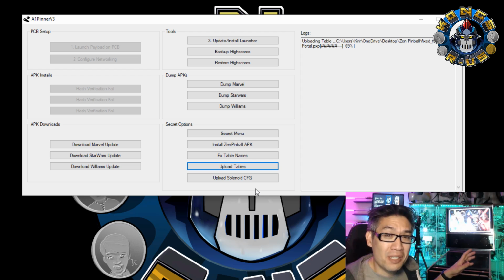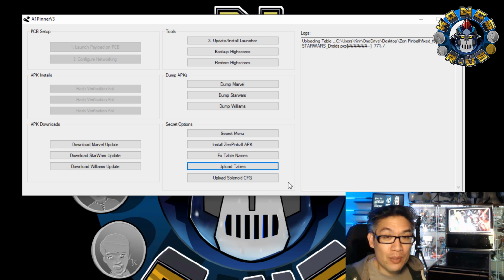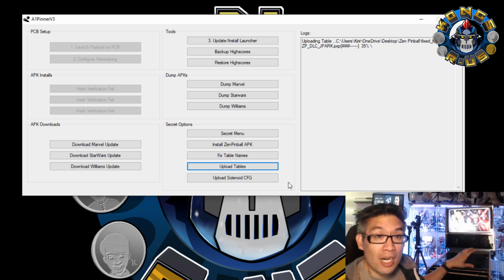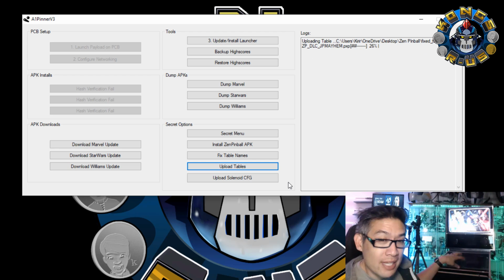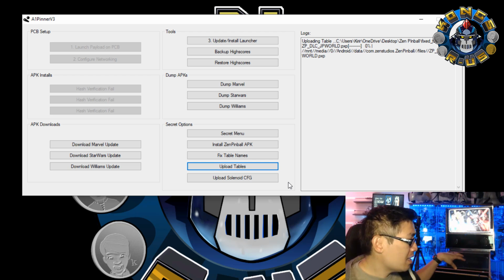mod? And so Mystery Encoder essentially reverse engineered some of the scripts that have been created, not scripts, it's DOF links, right? DOF links is another program that listens to FX3, and if you set that up, you can have it fire solenoids that you hook up if you're setting up a virtual pinball machine. He reverse engineered that and figured out how to get the solenoids to listen to actual events and trigger them using the stock software.